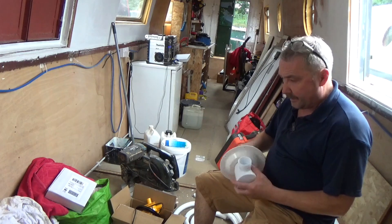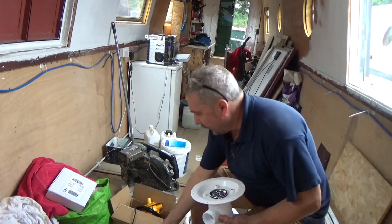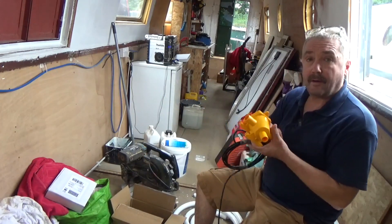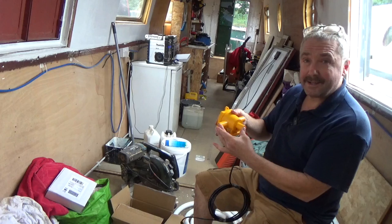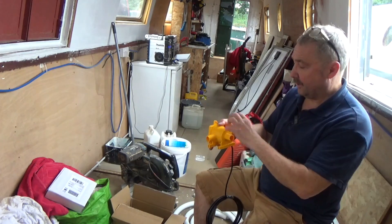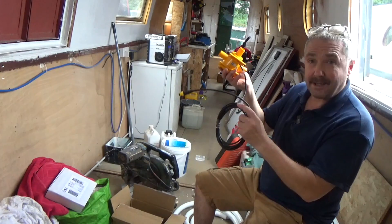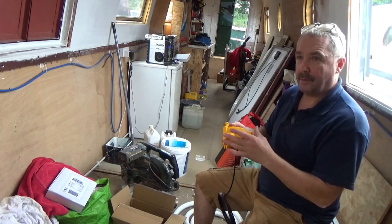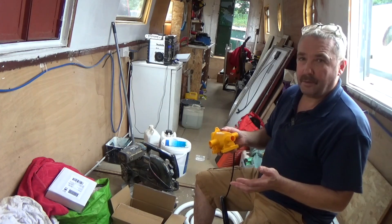Next job then is to sort this waste out and the pump for the wet room. We've got this Whale system, which consists of this valve - it's got a plug-and-play end on it that goes to the pump. You can have two inlets to that, so you could put a sink in it and a shower, and then an outlet. It doesn't matter which one - water goes in and pumps out. There's a little gizmo on the bottom that detects the water when it's in there, turns it on, sends a signal from this to the pump, turns it on. So I could put the sink in it and also the shower.